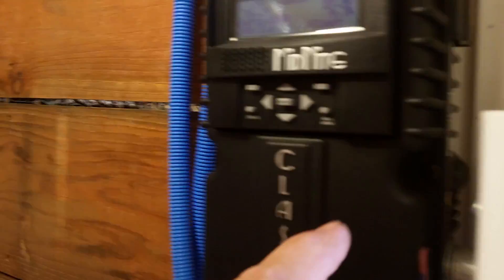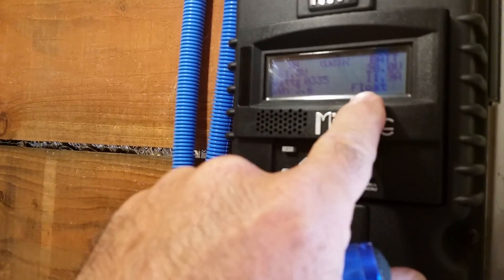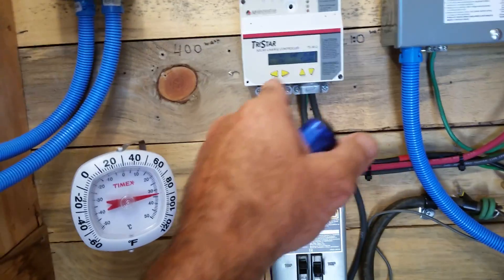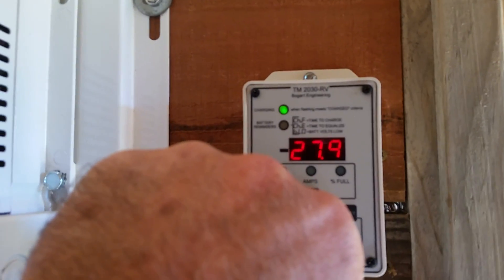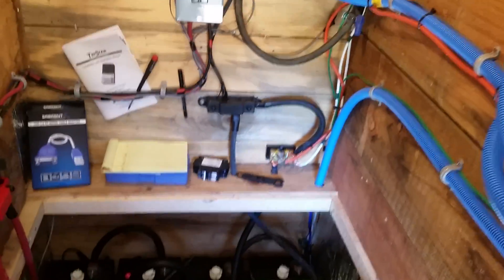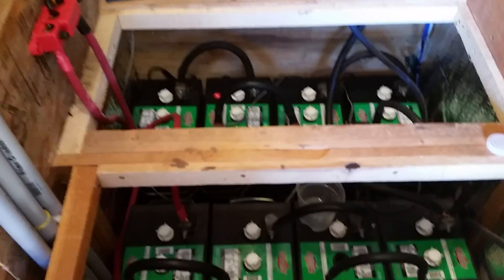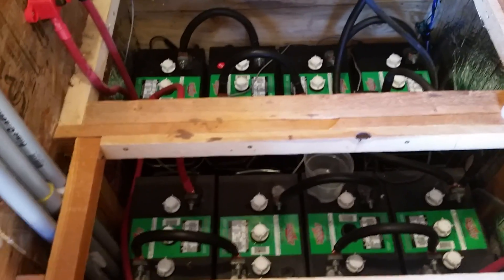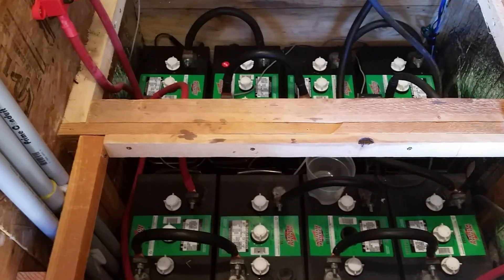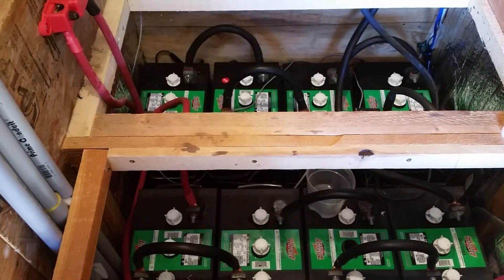Because of my elevated float voltage, which is set at about 28 volts for a 24-volt system — it's holding float right now at 27.9, 27.9, and 27.9 to 28 volts — that's elevated, but that's also helping keep the plates clean. And the only thing it costs me is watering my batteries every three months rather than every six months. And if I can make my batteries last many, many years longer by doing it this way, it's worth it — just get up here every three months and put a gallon and a half of water in.